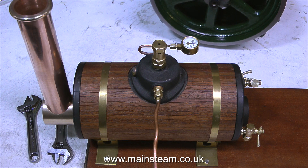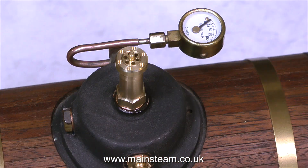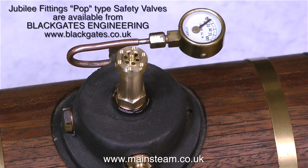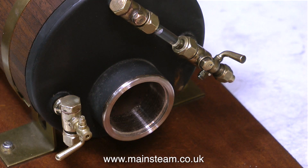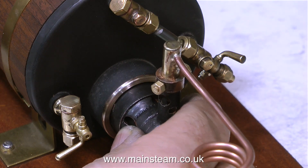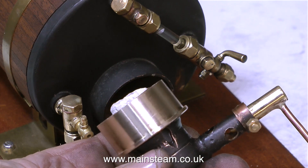Here's the Stuart 3500 series boiler that I've been working on recently. It's fitted with the Stuart Models safety valve, which makes a horrible noise. I went up to Blackgate's Engineering and bought one of these - it's a Jubilee Fittings POP type safety valve, and these are really excellent things; the type of safety valves I use most of the time. I'll be testing it shortly on steam, but first I need to raise some steam by fitting the burner into the flue tube using the adapter you've just seen me make. There's no rocket science here - it was a very simple job, and it allows me to fit this small ceramic burner into the larger flue tube.